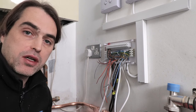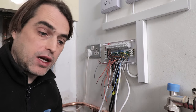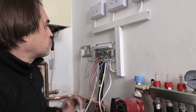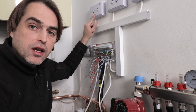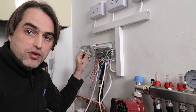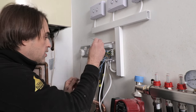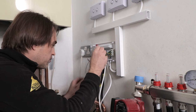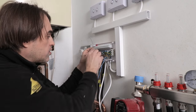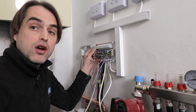Now we have to pay a bit more attention when we start dealing with switched lives. All permanent lives, earths and neutrals are done. Now we wire how those switched lives are going to switch things on and off. The first wire is from controller one for central heating, connected to terminal two normally open — that grey wire marked 'one' — going to the brown of the central heating zone valve, zone valve number one. I put a brown sleeve on the grey wire to mark it as switched live so you know which ones are switched lives when you open the wiring center.